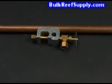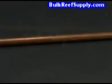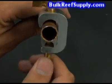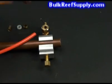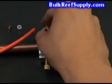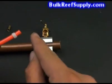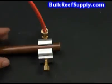Instead of flexible tubes, your sink may have rigid copper lines. Due to placement, some customers choose to attach directly to their home's copper piping. To do this we're going to use a self-piercing saddle valve. Locate the seat of the saddle valve, which has two different sizes — figure out which size is right for you and place it on the pipe. Then slide the rest of the seat clamp on and use a wrench to crank down on the nut on the bottom to hold it securely in place. To attach the red water supply line, unscrew the brass nut and slide it onto the hose, then slide on the plastic ring making sure the thin side of the bevel is closest to the end of the tube. Insert the brass insert and screw onto the saddle valve.